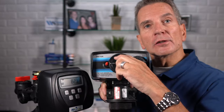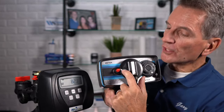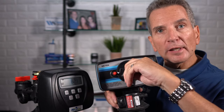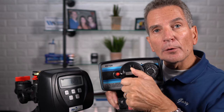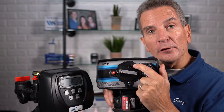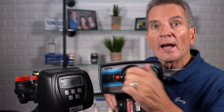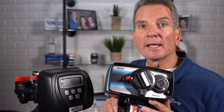If you have an older style mechanical water softener like a FLECK 5600, you can check the cycles by looking at the window — when you see the word 'service' displayed, it's in service. You can turn it to put it through the cycles. If water is continuously flowing to drain and it's stuck and won't move past a certain point, it's seized up inside and you need to replace the seal pack and the piston.